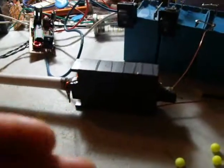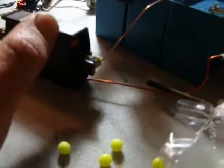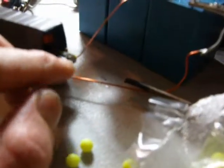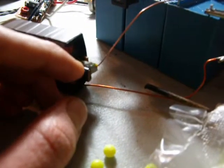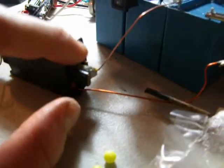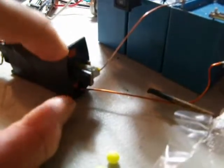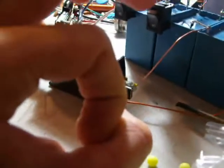This one is actually durable. In addition to those two coils pushing the plasma towards this end, I have another coil wound just around the barrel in a regular coil gun way. This coil, as I think, protects the barrel from plasma touching its walls, because the magnetic field of the coil wound around the barrel is stronger near the walls. So this way it will probably push the ions somewhere close to the middle of the barrel, in the center.